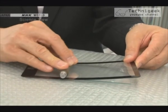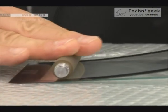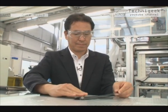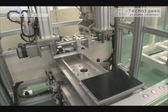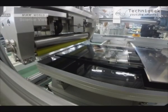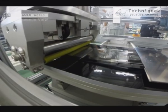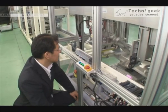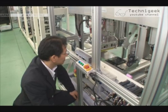Yet objections were raised at the thought of the glass being handled in this manner. Wouldn't it crack? Wouldn't it warp? These were just a few of the questions that were raised. However, the Takumi was unmoved. I gave it a go because I felt that innovations were being overlooked because people weren't willing to try something new. The glass on top is tilted slightly as the sheets are glued together, and a roller pushes out the air as it presses the two sheets together. There is no cracking or warping, and the defect rate was reduced to under 1%.